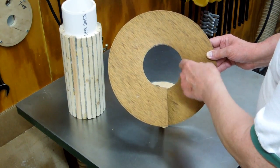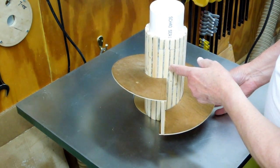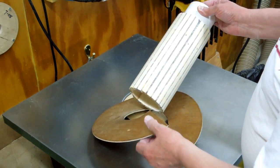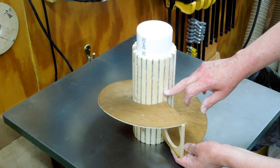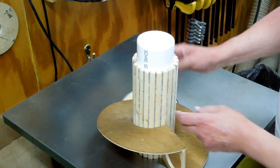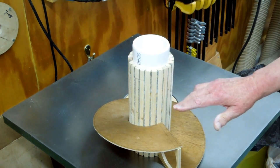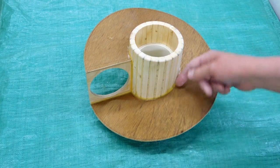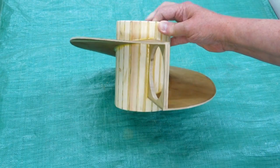I was pretty close with my estimate of where to sand for the pipe to fit down in there. When this ramp is glued to this piece of pipe, I want this bulkhead to be fairly vertical — doesn't have to be exact, but pretty close. I'm going to cut this off square on the compound miter saw; I only want it to stick down an inch or so below the ramp. This piece of pipe will stay in there all the time I'm gluing the ramp to the wood, to make sure the pipe stays round, and it's intended to slide up and down so I can play it like a trombone to find the sweet spot for the air return. This assembly, glued together with fillets on both sides, would make a pretty good auger.